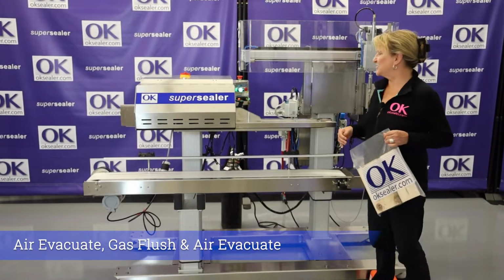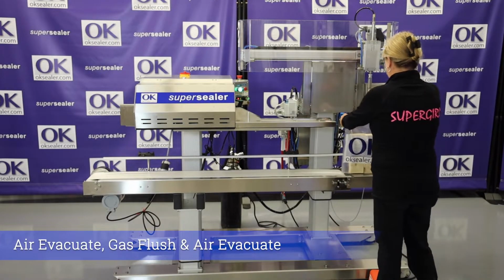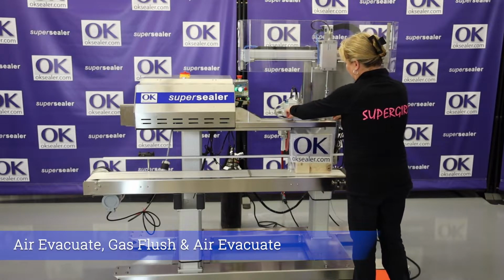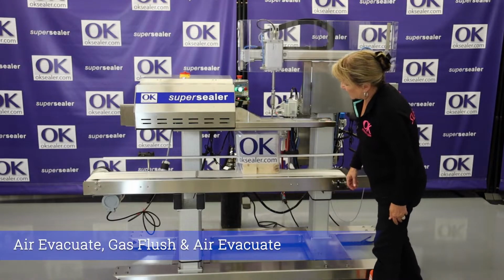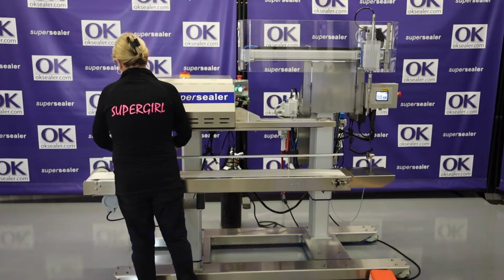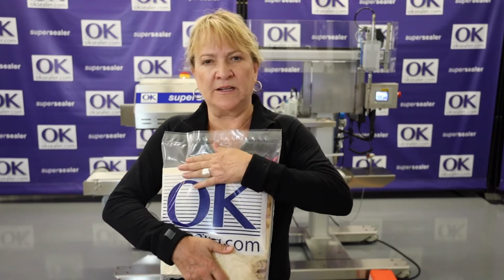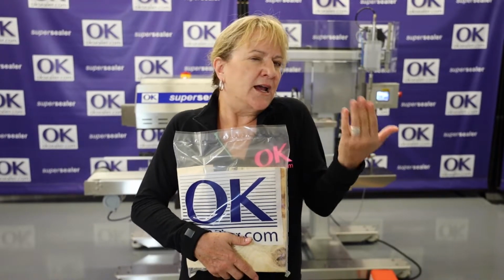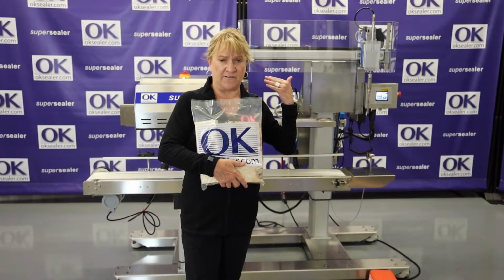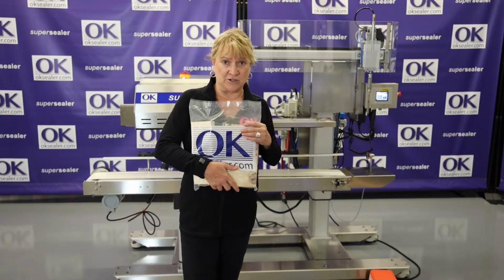Okay, now what we're gonna do is we're gonna air evacuate, gas flush, air evacuate. So, I'm air evacuating right now. Now I'm putting gas in at about 3 seconds of gas, and then I'm air evacuating. So you can depend on how you want to do it. This particular one, I put more gas in so it's not really super tight, it's got more gas in. Your timer is what it is. You want to put more gas in, less air evacuation, or more evacuation, just a little bit of gas. That can all be determined on the timer.